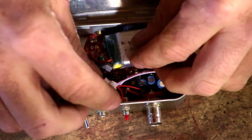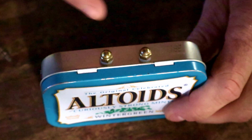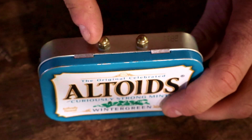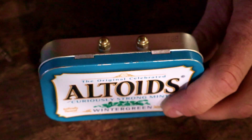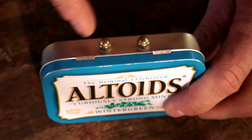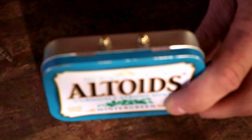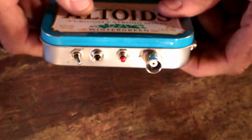The touch points are on the outside here on the back — these two brass cap nuts on the back of the radio are the touch points, the key. Touching this right here with just a very gentle touch activates the capacitive circuit and acts as the right-hand side of your paddle to send dashes, and the left key here acts as the left-hand side of the paddle and lets you send dits.